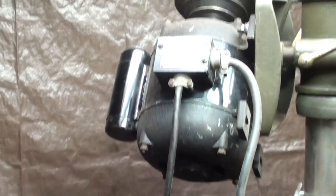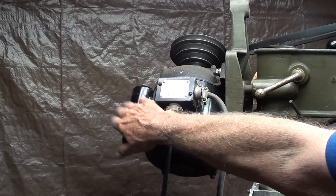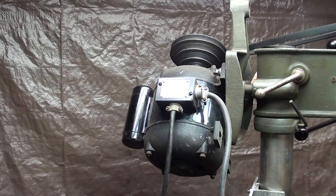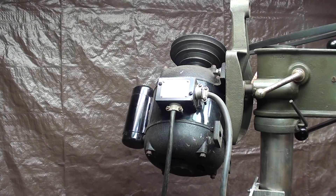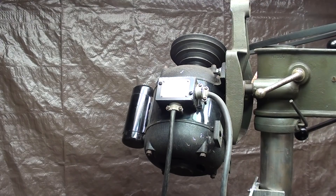I'm making some progress — I've got the switch off and I've got one bolt left to take the motor off. Now, this is a capacitor start motor. DC motors never have capacitors on them — that's an AC thing. In the previous video I talked about that 1/3 underpowered horsepower motor on the Duro drill press and how it could barely start under the load of the full gear. The whole purpose of capacitor start motors is to give it that extra oomph for starting. Both of my Delta drill presses were equipped from the factory with capacitor start. It gives that extra boost only during starting until the centrifugal switch kicks it out, because there are two sets of windings in these split-phase motors.